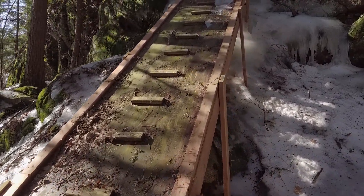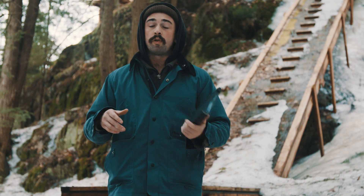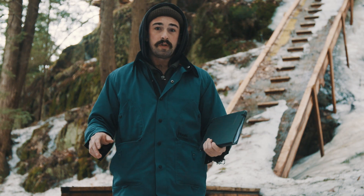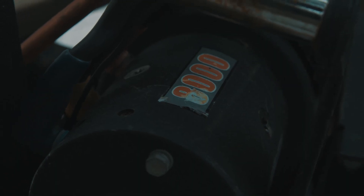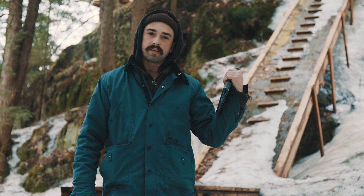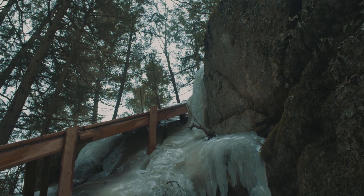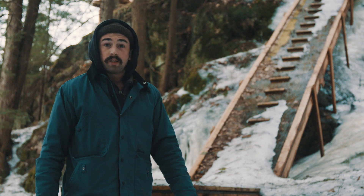Speaking about limitations — I've put almost a full cord of wood on it, which is crazy heavy, and never had trouble. Sometimes the winch is really straining but it's super strong. The winch is rated for eight tons, though I don't actually want to pull eight tons with it. If I had to do it again I would maybe use bigger posts — four-by-four — underneath instead of on the side, because this setup is a bit sketchy, but it works. It's been there for three years and it works great.